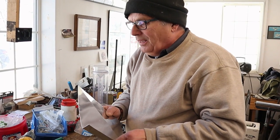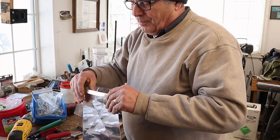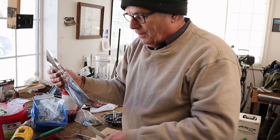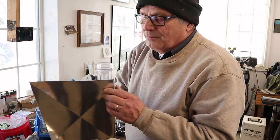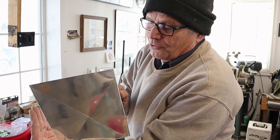Unfortunately, this will not be our final attempt at making this piece, because there is one small problem. This is 25-thousandths aluminum, and when we did the hems we didn't catch it at the time, but when we bent the hems it actually cracked and started peeling up on one end. So we yanked them off — these are the actual hems that were on here — this isn't going to work. Since this metal is only 25-thousandths and it doesn't like to be hemmed due to fatigue, instead of hemming it we're going to bend them 90 degrees. It can take a 90-degree bend, but 25-thousandths aluminum won't take a 180-degree bend without fatiguing. So we're going to remake the side pieces with a 90-degree bend on the bottom and a 90-degree bend on the trailing edge.